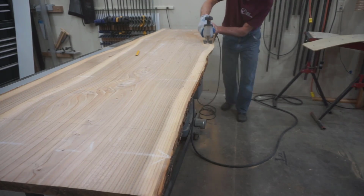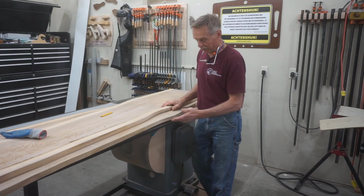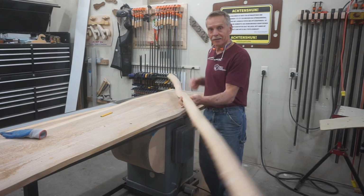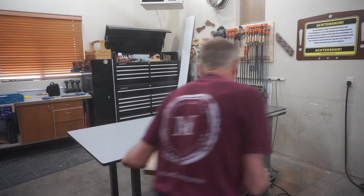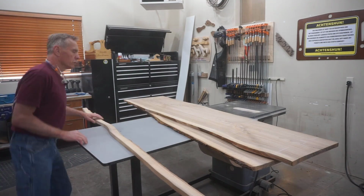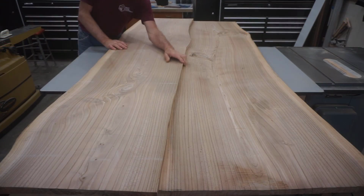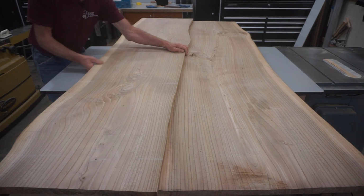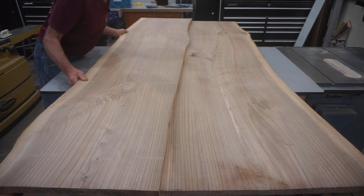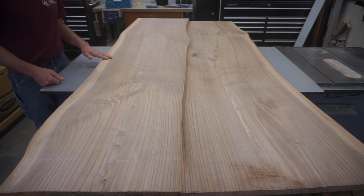You gotta love what a high-speed video clip can do to speed up a cut like this. And it's kind of hard to imagine that a wavy cut like that is exactly what I'm after. Once that initial rough cut is made, I'll just pivot the pieces around, prop them up and overlap them to see if I want to make any adjustments for the fit before I set about making the pattern. And naturally, the contours aren't going to match perfectly from piece to piece, but if I nest the bump and the knot and a few other features, it'll disguise the joint nicely.